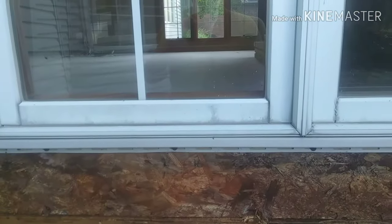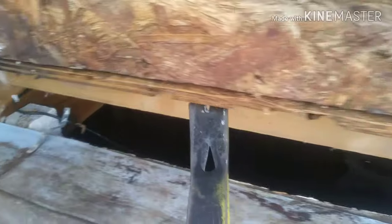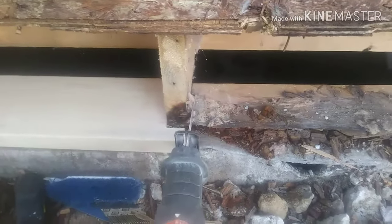Those straps hold the sill plate to the masonry. I'm going to do half and half — I cut this half out, the block is solid back here, and I think that's probably what saved this thing from sinking. I'll do the first half on the left, get it all cleaned off, get my sill plate in there, then do the other half. Make sure you clean off the bottom edge of your subfloor so you don't hit anything when you go to put your rim in — you want it nice and snug.